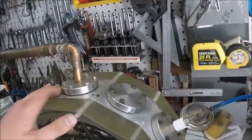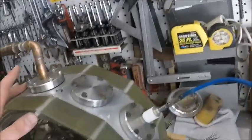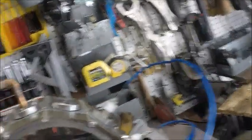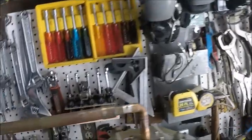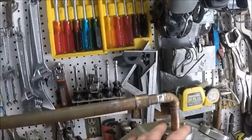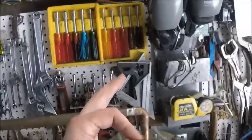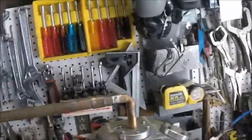It's designed for high vacuum applications, so it has all these vacuum ports — one on each of the 12 sides. I have a variety of different caps for them, including these two high voltage insulation caps. I have a couple other pass-throughs, primary vacuum takeoffs — there's a small copper one, and also a large version for high flow-through volumes.